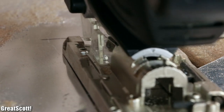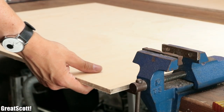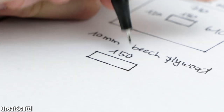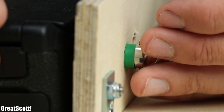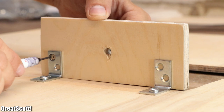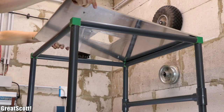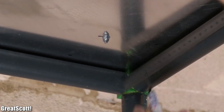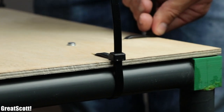Next I cut out the previously mentioned camera hole, and continued by bringing in another piece of beech plywood with 10-millimeter thickness, out of which I created a square with dimensions of 15 by 6 centimeters. I drilled a hole through its center which I will later use in combination with a special camera mounting screw, and added the square with brackets and M4 screws onto the ceiling parts right next to the camera hole. To finish off the ceiling, I placed it on top of the PVC pipe structure, marked a couple of holes along its edges, and drilled those so that I can later secure the ceiling to the main rig body with the help of zip ties.